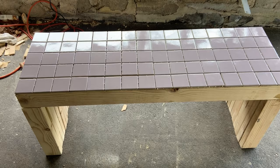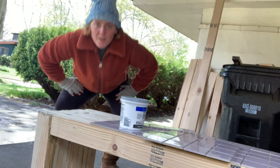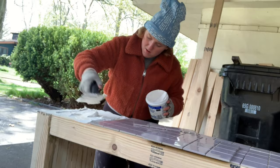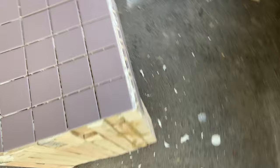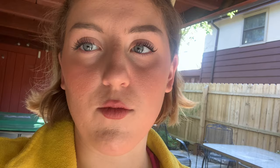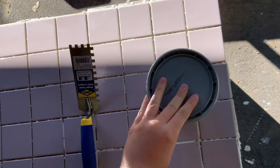I've laid out the tiles on the tabletop just to make sure the measurements worked — thank god they did. Here's the tile adhered so far. I did two of the sides but I'm out of the adhesive already, though honestly it looks so pretty. The color isn't doing it justice in photos. Day four: I'm going to finish adhering the tile and probably grout today even though you're not supposed to grout the same day — I'm really impatient. Got a smaller trowel and more adhesive, and I'm wearing gloves this time.